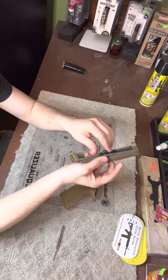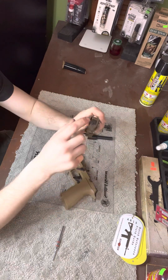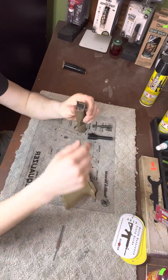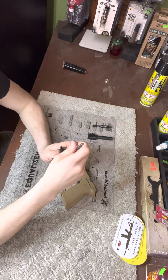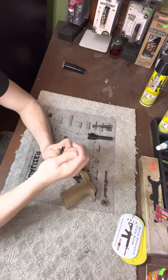After that you're gonna push up on your barrel. The barrel comes out, and then to take your backing plate off all you have to do is get a file or a punch and push down on your extractor spring guide.